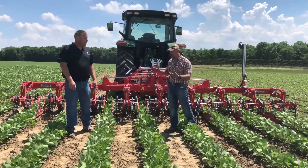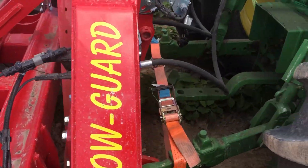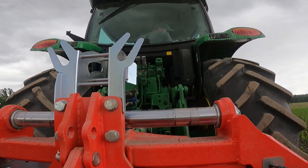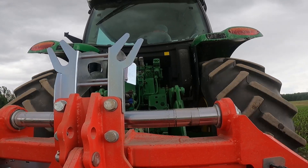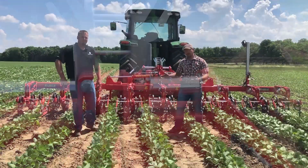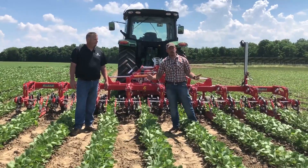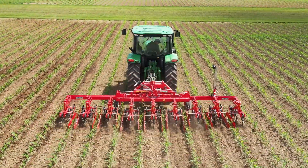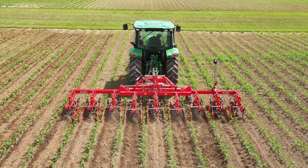So the adjustments are really special. The other thing that is special to this machine is the row guard, and the row guard is the camera system. The camera system allows me to cultivate without looking back — it's going to shift side to side and keep that cultivator from tearing out any crop. When I learned how to cultivate as a kid on a 40-20 John Deere, you weren't allowed to leave third gear idle, which made for a very long day. Today, farms are bigger and covering acres quickly is important. The row guard allows us to do that.